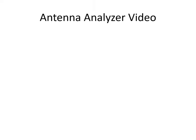There's one thing I wanted to expand on from that video. We took a range of frequencies and measured standing wave ratios, and you can see the minimum value is somewhere in that 50 kilohertz spread. If you want to zoom in with more resolution, use the same approach but break the incremental frequency steps into smaller steps and record the SWR values the same way. That'll show you with more precision where the actual resonant frequency is.